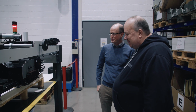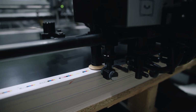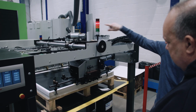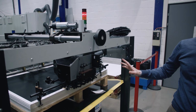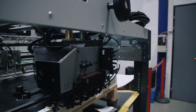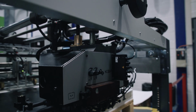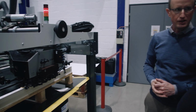it's very reliable. And maybe it's a stupid question, but when you have a feeder like this, is it just like mounting it, or do you need to do a lot of software and adjustment to the solution? So we just mounted and assembled it on our feeder frame, and we don't have to do any adjustments because everything is fully prepared inside. We do all the drive system, the timings and everything, but the suction head itself comes like it is.